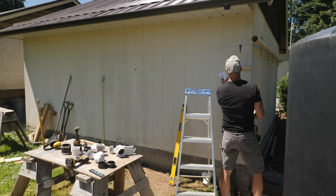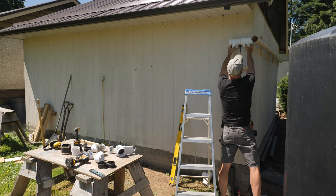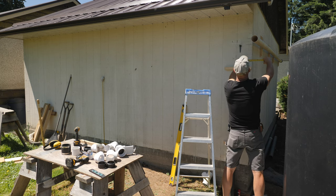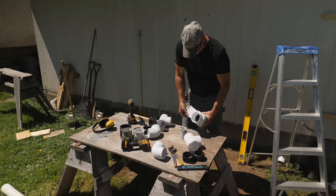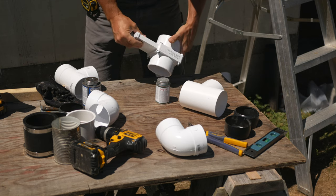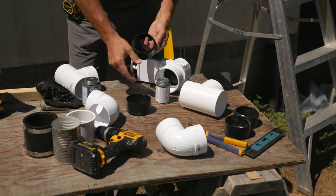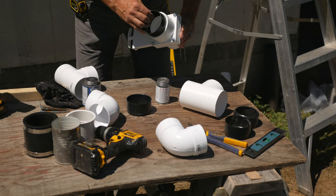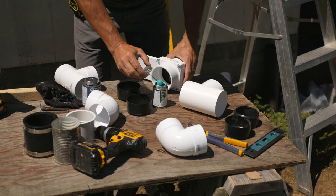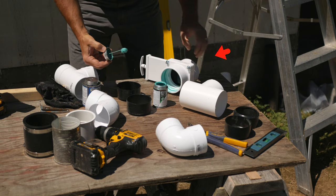On the opposite side of the smaller workshop I'll put together another pipe and fitting assembly like the first one. The gate valve and the T at the top of the first flush diverter are designed to fit a schedule 40 PVC pipe. That's a thicker walled version of the three inch drain pipe I'm using for everything else. So I need to first glue in these sleeves or adapters to allow me to connect everything together. I could only find the black ABS sleeves but they will work fine.